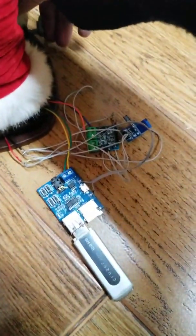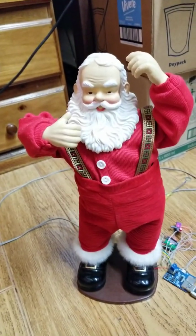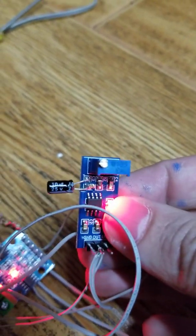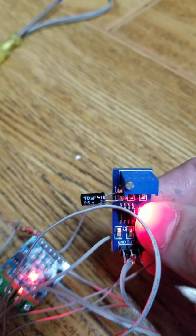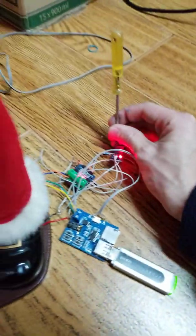Get ready for a little Christmas light show here. As you can see right now, it is dancing, but it's dancing kind of slow — and it's doing that on purpose because I'm going to show exactly what you do. After you replace the capacitor — I left the original SMD capacitor on there just in case — I put a 10 microfarad over there and that's going to do the trick, making it go slower. What you have to do after that is adjust this potentiometer: tighten it up and the thing goes faster.